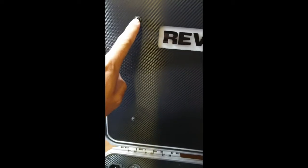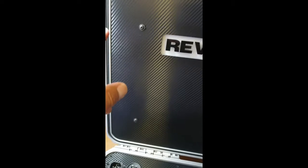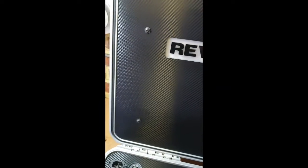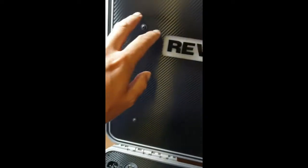Up to the deck, the upper deck, we've got four fixing points. Again, you'll see from the photos how I've done this. There are mounting points in the lid. So I created spacers which allow a self-tapping screw to go through one end for a 3.5mm hole from memory, and then at the other end I created a slightly bigger hole. Again, these were 3D printed.